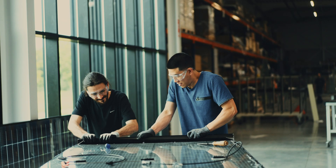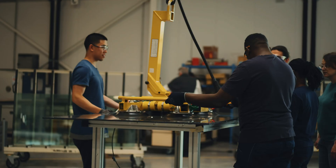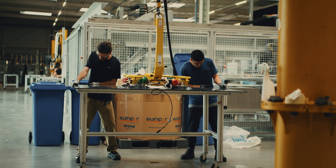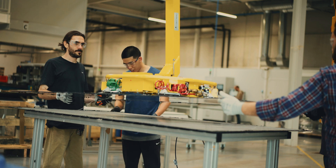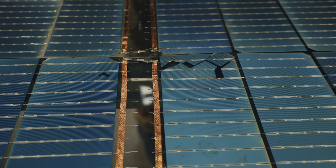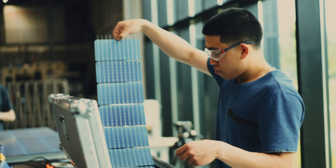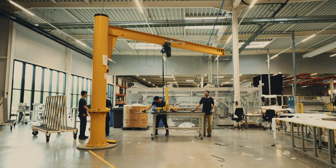So to disassemble and repair a solar panel, first we have to remove the frames. Then we have to use this huge machine with suction cups that lift the glass a little bit, and during that process we will also remove the edge seal, which we replace to glue our layers together. After that, we inspect which strings are broken, then we desolder the broken strings and replace them with the functional ones. When the repair is finished, we take the glass that we took apart, place it back, reseal it, and then the process is complete.